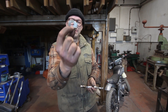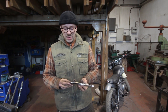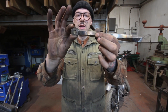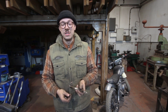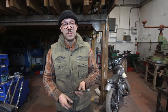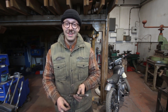Something else I've done is changed the shape of the tabs. Again these should look a little bit nicer once we've welded them in and then we'll go across with the flat disc one final time and just clean it up. As you can see they slot in there quite nicely, which means it's time for welding. I'm not actually going to be using the MIG welder for this — I'm going to be using the TIG welder. The TIG welder is really great because you can get a much neater finish and it saves you having to load a stainless roll onto the MIG welder. The catch is I'm absolutely crap at TIG welding, so it's a good thing I'm good at grinding — we're just going to see how this goes.